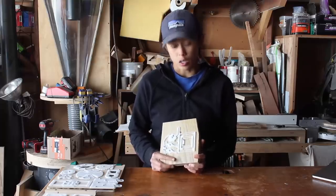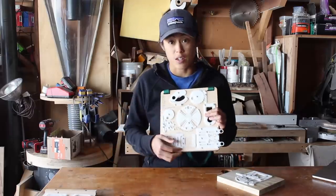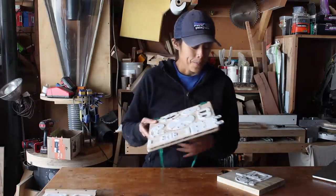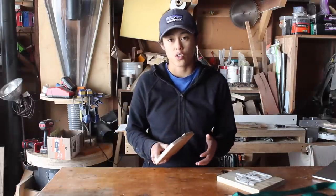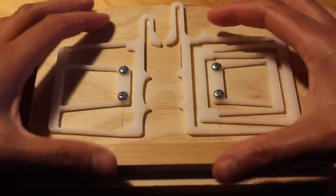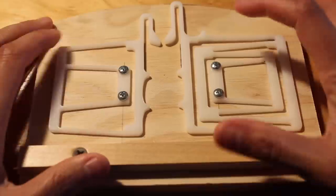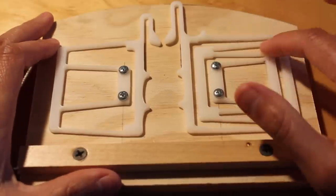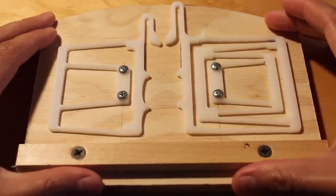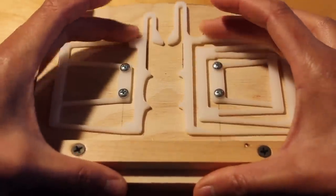I also thought it'd be fun to talk a little bit more about this linear slide flexure — it might be very familiar to some of you, I even showed it in a previous video. Like most flexures, it's not really designed to have a lot of deformation. You can see these two examples: they're traveling the same amount, but each of the bars on this side are deforming much more than the ones on this one. So by nesting two of the side mechanisms together, I can get the same travel with less deformation and actually less force. That's all I have to say about flexures for now.